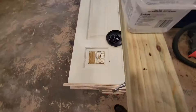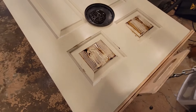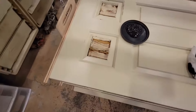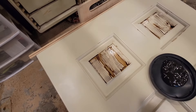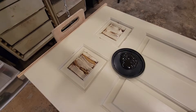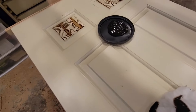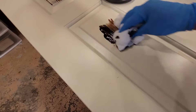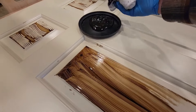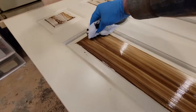There's not really a specific speed — you can go pretty fast or real slow. Really rock it back and forth to make some interesting looks. Right now it looks like very contrasted areas, really white against really dark brown, but this is going to get three more coats of darkening over it, so all of that's going to blend together and look natural with natural variety in the different colors and grains. You don't need to go really fast — if you do mess up, just wipe it back over and do it all over again.